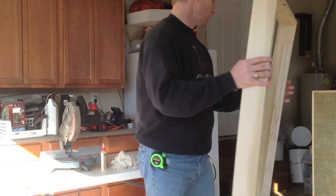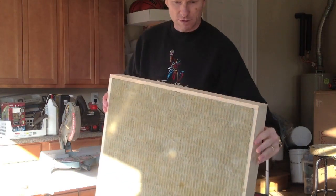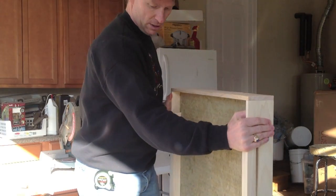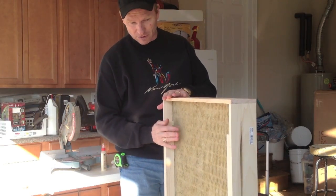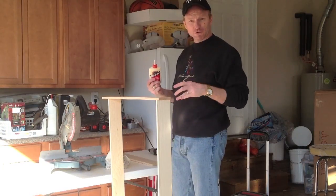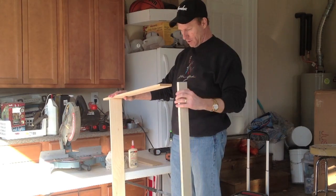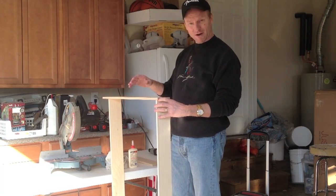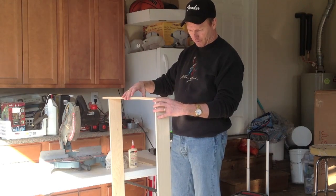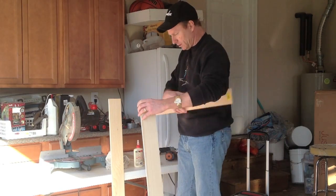Other people will tell you to mount panels two inches off the wall; this gives you the same effect but easier to do. Here's a completed panel minus the cover material, which includes the insulation. You can see the inch-and-a-half gap between where it hangs on the wall and the actual material. It takes just a few minutes to put together. Now I'm going to build one from scratch — this 48 inch board I bought from Lowe's as-is; the 25 inch top and bottom I had to cut down from 36 inch boards.